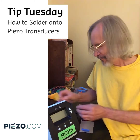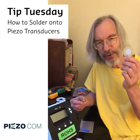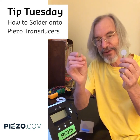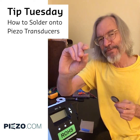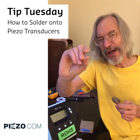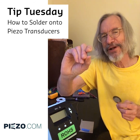Now in order to make a joint, you've got to pick a piezo. We have two kinds here today. One is the easy kind — this has a silver electrode. The other is the more difficult kind, typical of the type sold by Mide. It has a nickel electrode which is only 1,000 angstroms thick. An angstrom being 10 to the minus 10 meters.